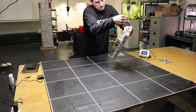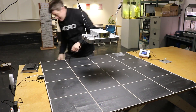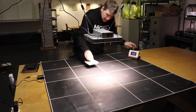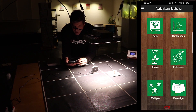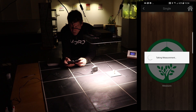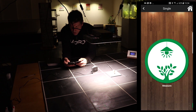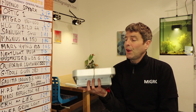I hung the light over the test canopy and used the Asensitec Passport spectroradiometer to test the spectrum. The spectrum is pretty standard — it is a full spectrum LED at 3,500K colour temperature, which is bog standard full spectrum output. There's a little spike on the red which I'm never fully convinced by, but nothing major to quibble about.